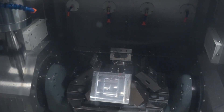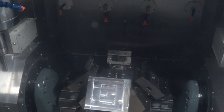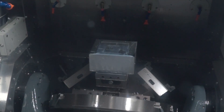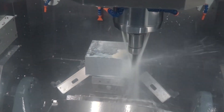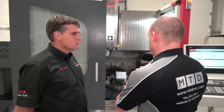I notice the table is supported on both sides — is it driven on both sides? No, it's a trunnion-style design, driven off one side only, but the bearings on both sides of the trunnion table are the same diameter, so you get equal support on both ends. The access is also very good for setting, which is an important point.